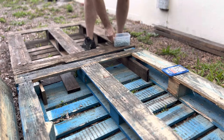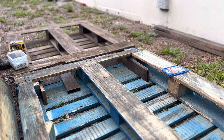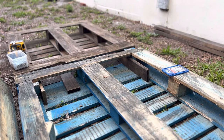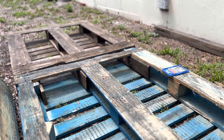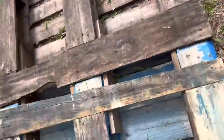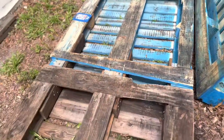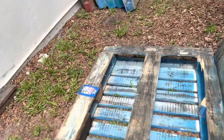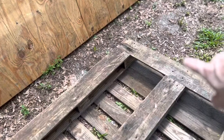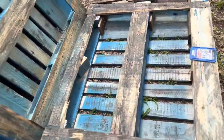All right, that's one side — we'll move over here and get this side done. I'm gonna go ahead and do the rest of these without recording the whole thing because it's kind of repetitive. We'll come back when we do the legs. So now you can see we've got our braces in on both sides of the center and both sides. I've got some used 4x4s — I'm gonna get those, measure them up, cut everything to length, and attach one in each corner, plus maybe one in the center for extra support.